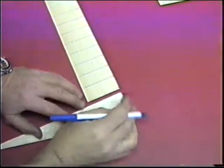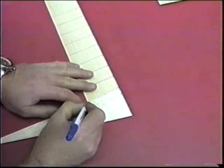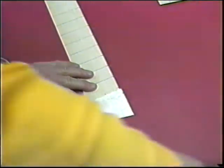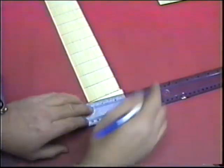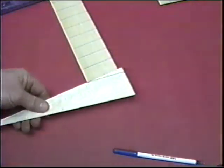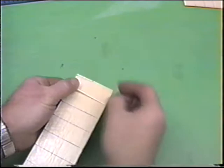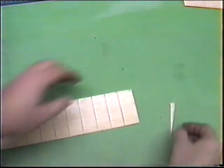All we need to know is that this is going to go down to 0. So we can have this right in the center. Actually, we can do it this way. Just make it a little bit oversized and then trim the 90 degrees at the front. Because we know each rib will be exactly the same length, and I'll just have to adjust my 90 degrees up in the front. Again, I'm using C-grain 16th. And then we'll trim that 90 at the front. Now I just want to see what this is going to lay in the way I want it to. Okay, now I just need to figure out how many of these I need.